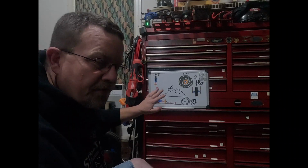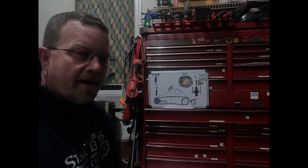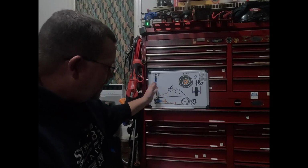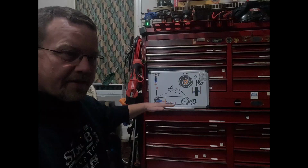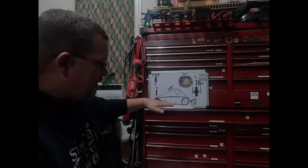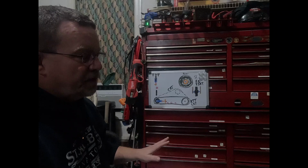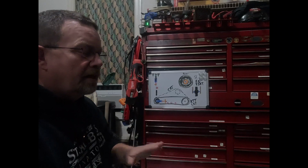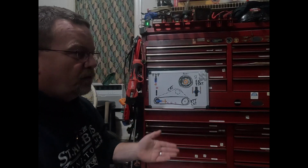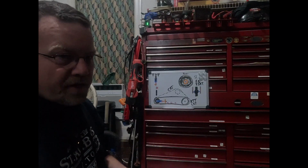Okay. So another thing is just to make sure that when you do have that happen, don't rush right back into putting that track on, because you might get another 5 feet and all of a sudden pop it right out. So here we go. When you go in there and let's say your track's off, one, get this up off the ground, as much as you can, the side that you are working on. Don't use the bucket. Hydraulics bleed down on everybody's machine, and it's a safety thing. If you can, get it up off the ground with whatever means you can safely, the side that you need to put the track back on.